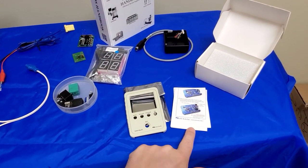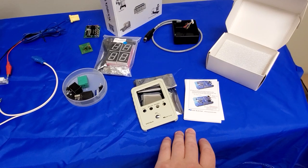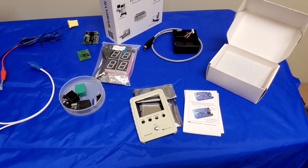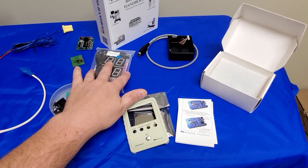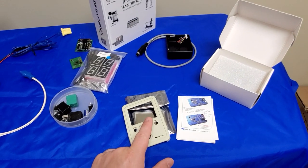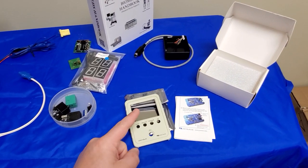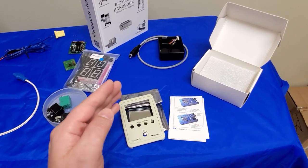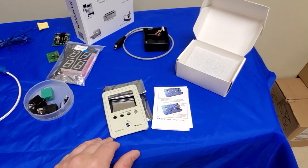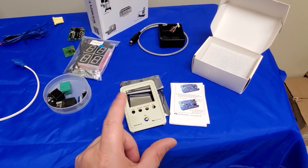This is a do-it-yourself assembly kit for an oscilloscope, and we're going to be working on that very soon. This one's mine — I'm going to assemble it, and then he's going to assemble his, and we're going to compare and contrast them. It's not only a practical tool, but he'll be building his own tool. It can be complex because there are different layers: the LCD panel, the LCD controller, and the measuring board are sandwiched together, so you have to be careful during assembly.